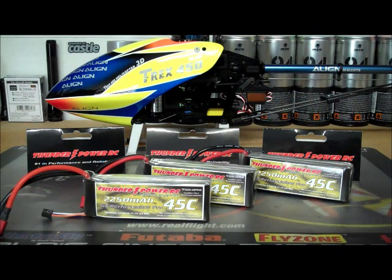These batteries here — I live in Colorado, so it's very cold during the winter, pretty much cold all year round. These batteries sit in storage mode in my closet for six to seven months at least. When I put them in storage mode, each cell gets dropped down to 3.8, 3.81 volts. After I break them out of storage mode and put them on a charger, they haven't moved one tenth of a volt. They're exactly where I put them. That's how good these batteries are.